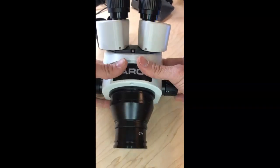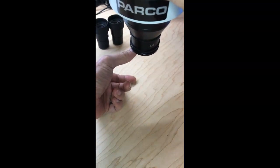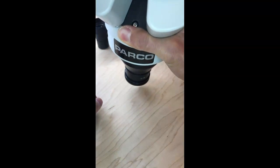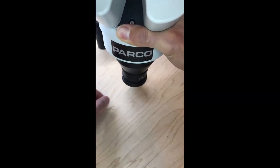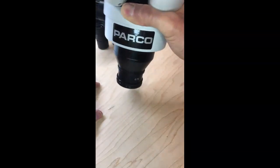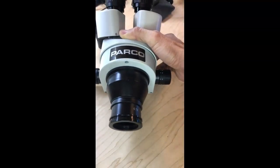The Barlow lens allows you a greater working distance to the tabletop. A 0.7 Barlow gives you about 3 to 4 inches, and a 0.5x gives you even greater working distance so you can stick your tools underneath the microscope while working. A 2x Barlow puts it really close, and that's usually used for biology specimen reviewing where you don't have to stick anything underneath. For micro-soldering, most people use a 0.7x or 0.5x Barlow lens.